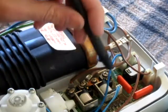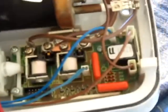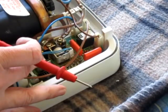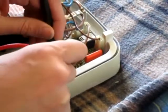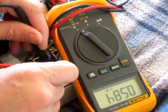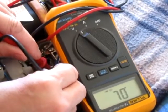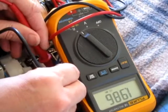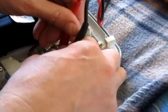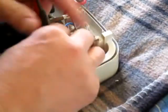If I was having problems with this now, I'd be changing the board or looking at the board. There's a lot of things on that board though. You can test all the diodes down the side - just put it into diode mode. You should get a reading one way and not the other. So I'm getting 0.6, flip around, and nothing. And on the other one it's 0.